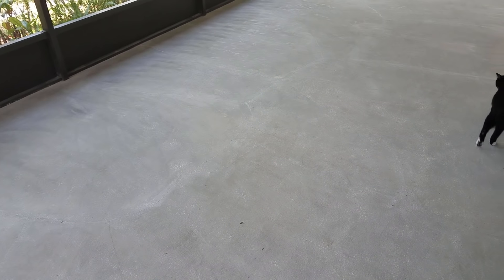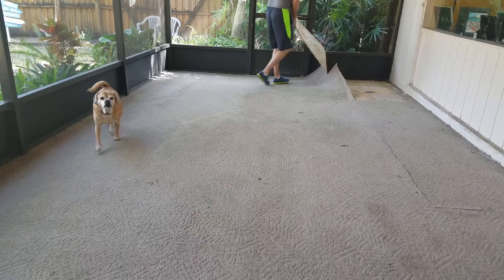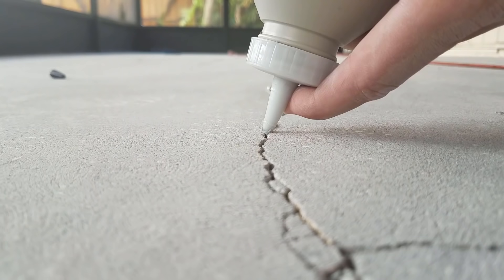In this video I'm showing how I sealed a concrete slab in our patio using Behr Premium Concrete Brick and Tile Wet Look Sealer. This is the last step in my patio project which began with removing the old carpet, using an angle grinder with a concrete wheel to remove the adhesive, and then filling some cracks that were left over. What I'm left with now is just kind of bare concrete.